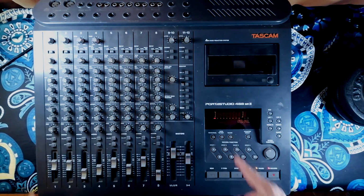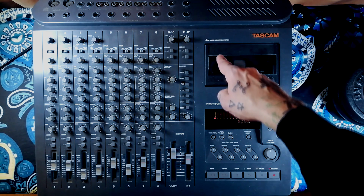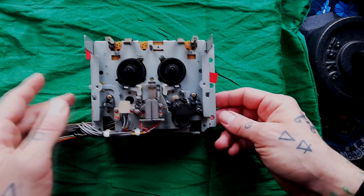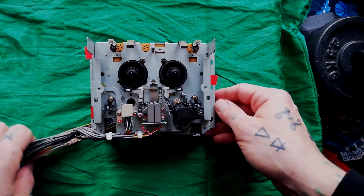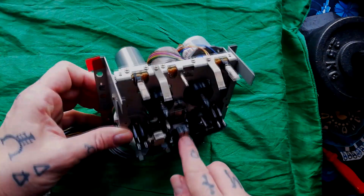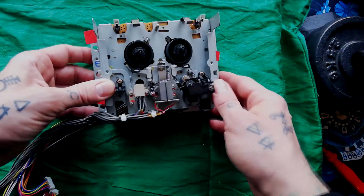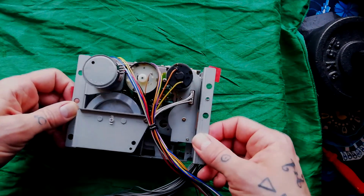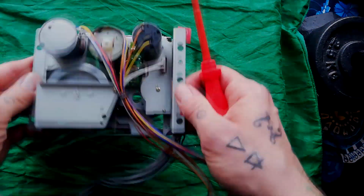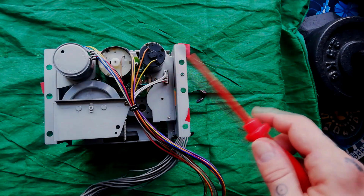I will open this up, and what we're going to see is the part over this side of the transport is going to look very similar to the 464. I'll be covering the process of opening the case and removing the transport in separate videos, so check my channel for those. This is what I remember from opening a 688 and a 488 Mark I before. You can see these much deeper magnetic heads. They're split into 8 segments. Back here it's pretty similar to the 464. To get at the gear C, we need to remove 1, 2, 3 screws. They're little bitty guys. Use quite a narrow Phillips type screwdriver to remove them.